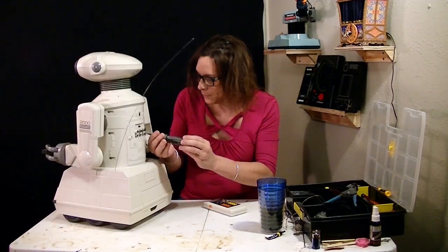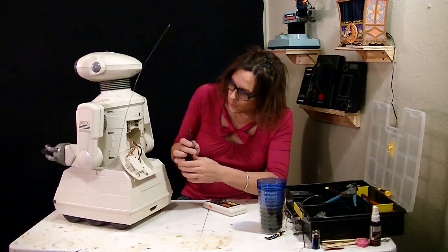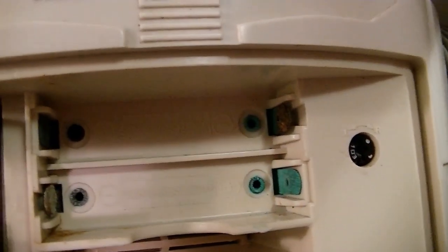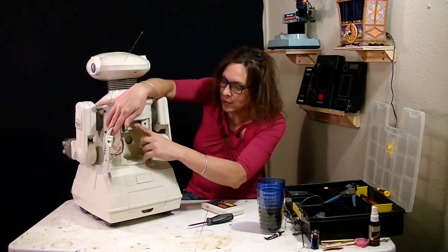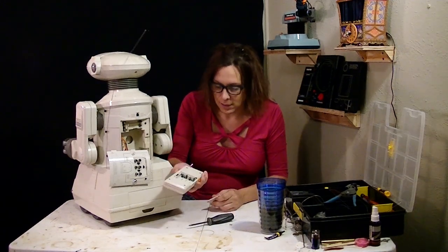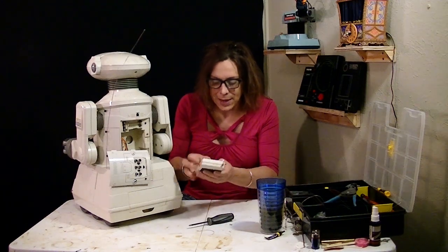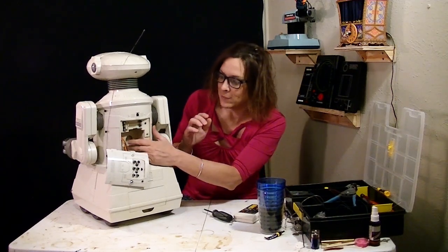If I open up this battery door here, you can see it's missing the main battery but I have one — it's the same one that's for the Omnibot. But the main thing I want to show you here is the corrosion on these ports for the batteries. So as I take that apart that's going to have to be fixed first. And the same thing on here — we have pretty much turquoise here. Seems to be even a broken terminal on this thing. So I need to get battery power going here, then I'll put in the Omnibot battery.